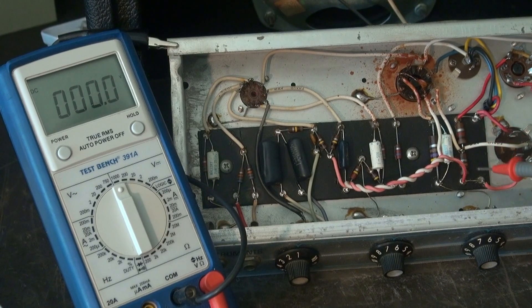Then we're going to a 10K resistor, and this is your preamp circuitry. There's a voltage for the preamp tube, about 385 volts - you're dropping some voltage across this 10K resistor. Now, this amp has not been touched - this thing is 100% stock. You're going to see when you look at your schematic that this high voltage, according to Fender's schematic, should be about 360 volts. Well, why is it at 415? The reason is this was designed back when the line voltages to your house were much lower, probably around 110 to 115 volts. These days we're up to about 123, so that is going to increase this DC level that you're seeing.